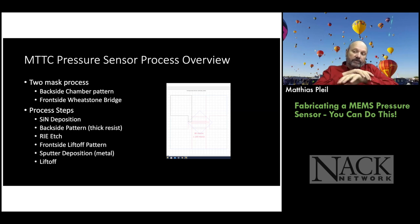What we do is we put the photoresist down first and pattern that, and then we put the metal on top of the photoresist, and wherever it's open, the metal is on the surface of the silicon nitride and adheres to it. Then we remove the photoresist and lift off all of that metal that we don't need anymore. So that's a lift-off process, which is different than semiconductors. So we do the standard pattern and etch the exposed regions, and then we do a lift-off process. You can see the students are learning different process technologies all along the way. Every step is different.